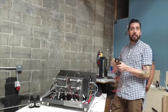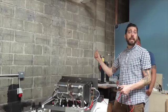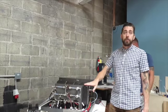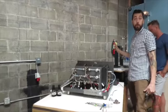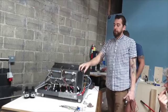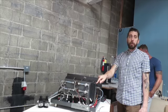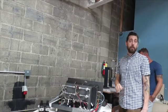So if those wires accidentally cross and you didn't turn off the machine, all it has to do is seek that V negative that has 24 volts, and you end up frying the op amp in here that's attached to the thermistor. So that's why anytime you're working on the machine, changing components at all, turn the power off to the machine. It's a little op amp attached to the thermistor, a 50-cent component that's soldered on there, but you blow it and you ruin a $200 computer for just not remembering to turn off the machine.